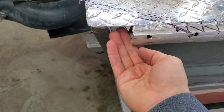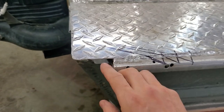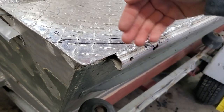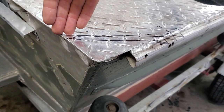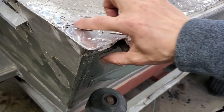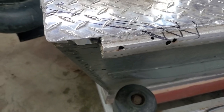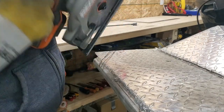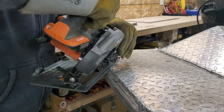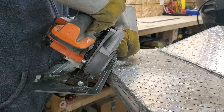I kind of want to stitch up the back of the boat here — there's a little hole and I could just put a piece of metal over it and close it up, but it's also an opportunity to improve the looks slightly. So purely for cosmetic reasons I'm thinking of taking my circular saw, cutting along one of these triangles, then cutting a little triangular plate and welding it onto everything. I've tilted the circular saw to 30 degrees, and I guess we're just going to hope this isn't a really bad idea.